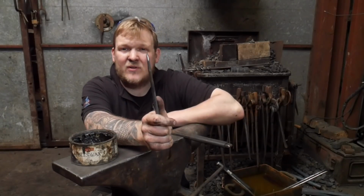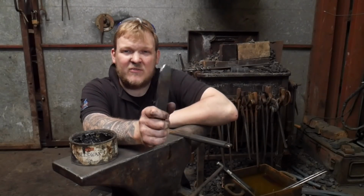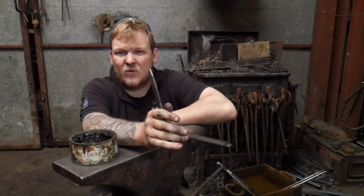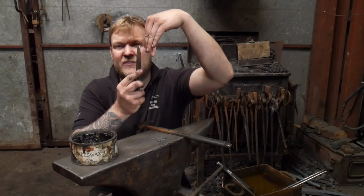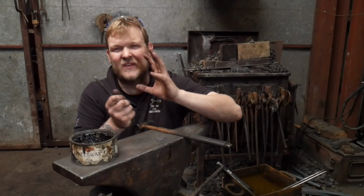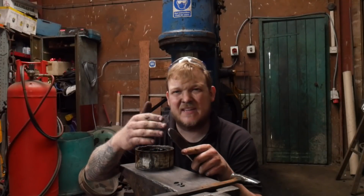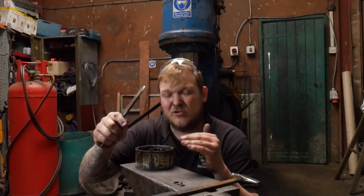I also am prone to using these bladed type ones with the curved ends. They work really well, they're very efficient. However, they can cause problems on crossover, where you don't punch the eyes quite in the same place and the two paths that you punch cross over, and then you get a bit of tear through, and that can be a little bit awkward later on in the punching process. I tend to find myself going through from one side 2/3 of the way, 3/4 of the way, and then flipping the stock over, marking up and kind of guessing where this one goes, and then going from there, because I seem to have better results, get less crossover and less tear out.